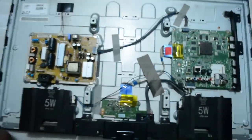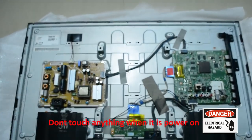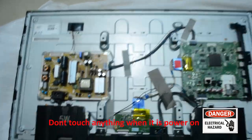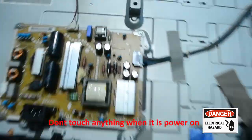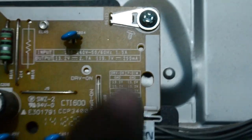Make sure it is supplying power to both the main board and the LEDs. First check these two voltages. If both voltages are supplied properly, then there is no problem with your motherboard or power supply. If it is not supplying power, then the problem is with either your power supply or your motherboard. If both are working fine, we can jump into the next step.